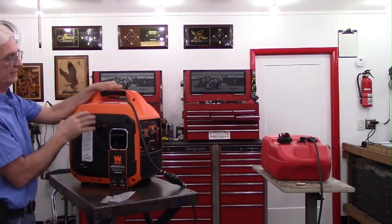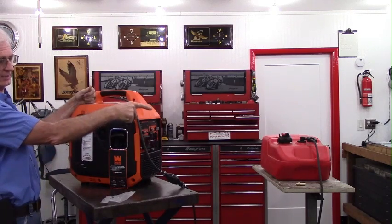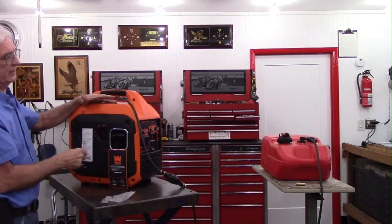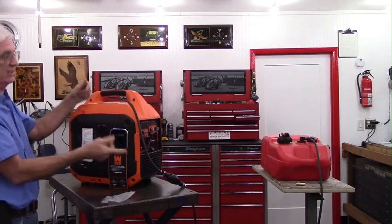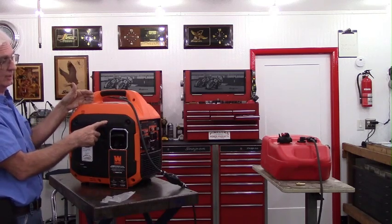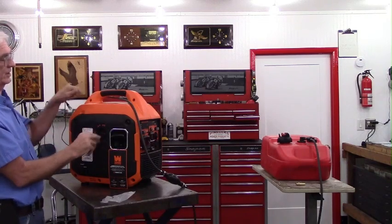This is a safety feature. It is to keep you from having the stock tank and the remote tank connected at the same time. That way it's impossible to transfer six gallons of fuel from the remote tank into the 1.6 gallon tank on this generator. If the tanks were connected and the vent failed to work and it pressurized in hot sun, it would overfill that tank and leak through the vent into the evaporative emissions canister and start dripping gasoline all over a hot engine. That's why it's set up to only connect to one tank at a time — fuel off position is remote tank, run position is the stock tank.